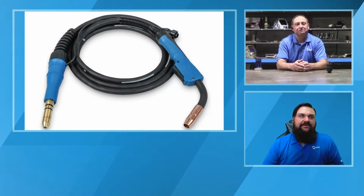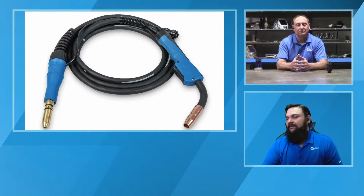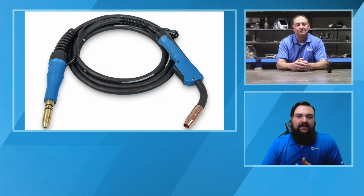Right. Those older style machines with the copper transformers and stabilizers, basically you're relying on the magnetics of those machines to give you a stable output. So the minute you start fluctuating what you're giving them, they start making that same change that you had on the incoming twofold, threefold, fourfold, so twice as bad or 3 times as bad on the output, whereas these style inverters are taking and leveling that out before it ever gets to the gun. Right.